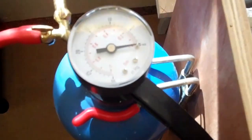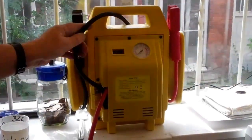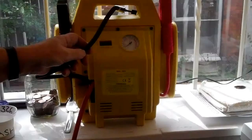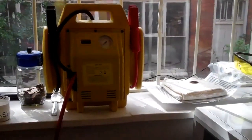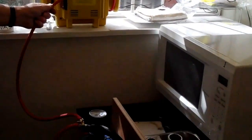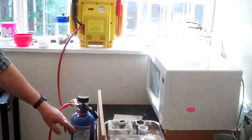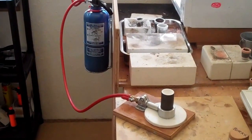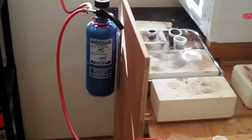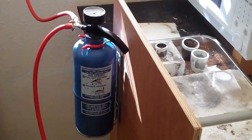The vacuum pump is a quick DIY conversion of a standard little compressor — a non-destructive conversion, it's still a useful compressor to have in the back of the car — but we've tapped onto the intake side, which works quite nicely. It pumps up this little fire extinguisher tank up to our twenty inches of mercury in just over a minute.